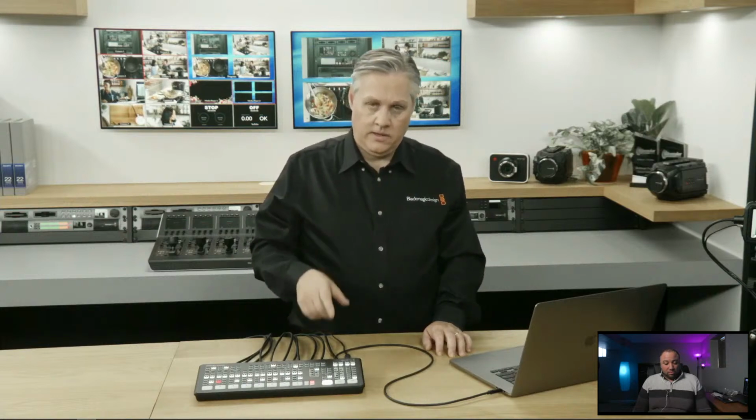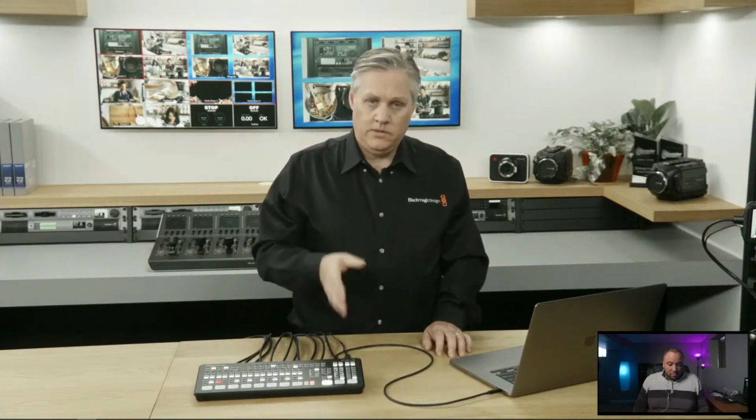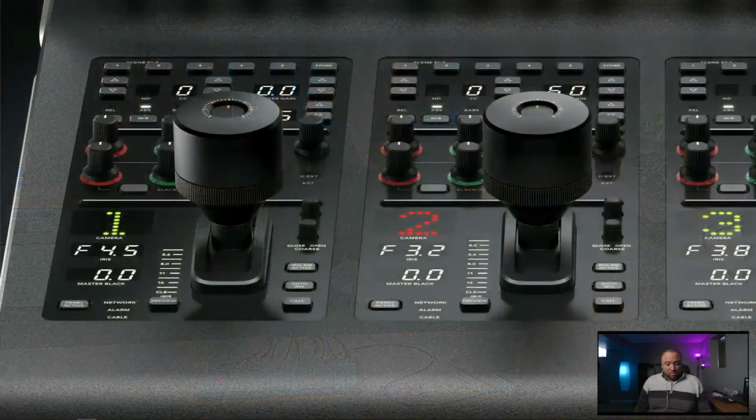And that's something that's used by camera operators, because they're proper aux outputs, you can use one of the outputs to give the camera operator a view of his cameras. So you can be using one of the video outputs for multi-view, while your camera operator is actually pushing the knobs and switching that second output so he can see what he's doing, and so he gets a chance to match the cameras by really quickly switching between them. There's also RGB knobs for tint, and that uses the color corrector in the camera. The pocket cameras, for example, have the color correctors built into them, and you can use the tint controls. There's lots of other controls as well.